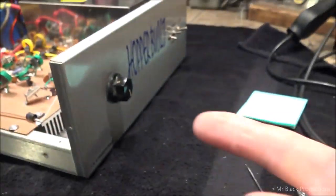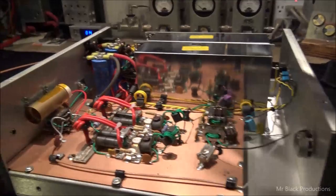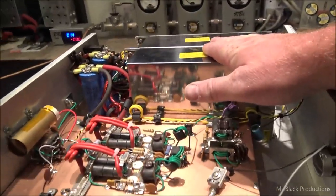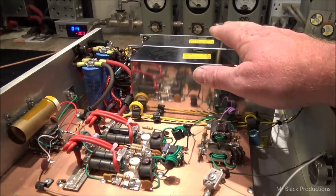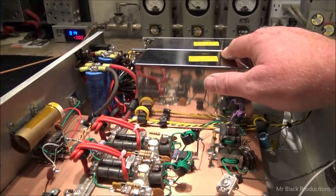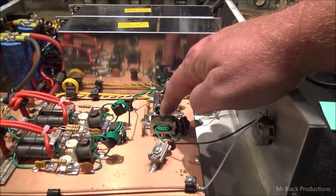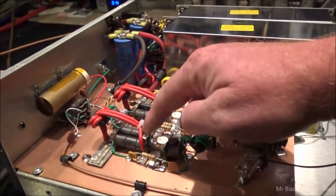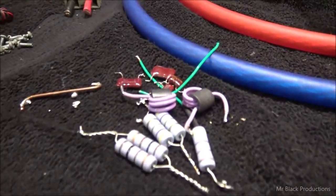Okay, Mr. Ron, here's your hopper box. I couldn't just put this one over there with the other ones. I went ahead and went through it. Turn the voltages up on the power supply from whatever it was. It was like 15 volts and went to 16.5, but underneath load it drops to 14.5 instead of 13.5. Had to take a turn out of the driver. It had too many turns in it. I added metal clad capacitors to your output transformers to keep them from breaking down. I basically changed out all these parts.